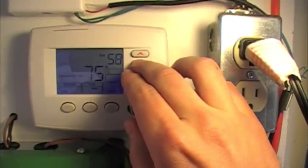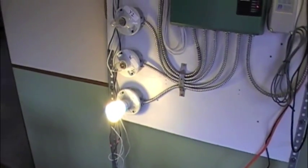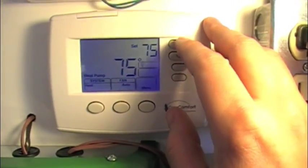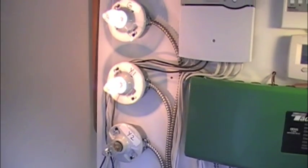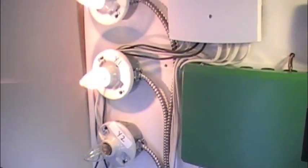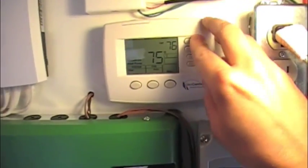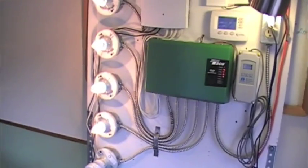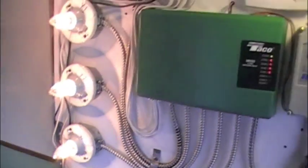Let's change it into the heating mode and take the set point back down — everything should shut off. Now let's watch what happens when we give it a call. We're one degree above the set point, we now have the fan running and one stage of compressor. Last time when we started turning this up we could not get second stage compressor or strip heat to turn on because of that ten minute delay. Now with fast action on, it should respond as soon as we do three degrees — and it did. It turned both on: second stage compressor and W terminal strip heat came on simultaneously.